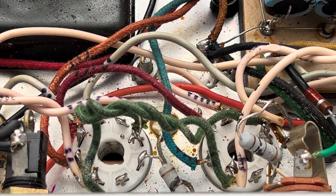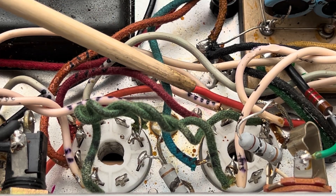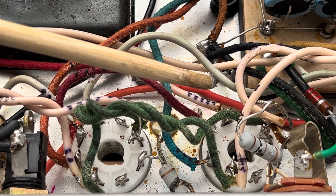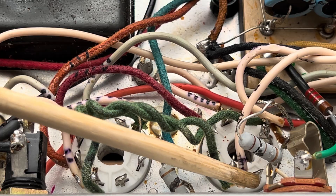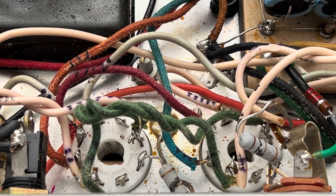I'm judging — well, I've done this before, but using tape, low-tech 3M painter's tape or frog tape. I don't ever mark up the chassis in any way that can't be removed without evidence I was there. So if you take a look, you'll notice these little hash marks on the wires — a different quantity on each wire. This one has five. Going clockwise: pin one, two, three, four, five. So these sockets were replaced, and each one of these hash marks corresponds to a particular pin number on these sockets. The guy didn't do a terrible job, but there's a need for some cleanup, and it's going to be a more extensive service than I was anticipating.